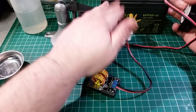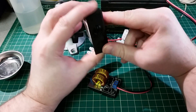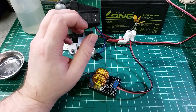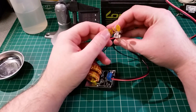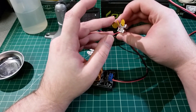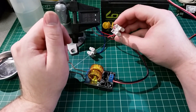Normally I've got my big lead-acid battery here — a big 12 amp-hour battery — with a little 3-amp breaker on it so I can mess around with stuff safely. But that wasn't going to cut it since this thing pulls more than 3 amps. Each of these poly fuses cuts out at about 3 amps continuous, with a hard cutoff at about 4.5 amps. The way we've wired them they'll do a soft cutoff first, then just about completely shut everything down.